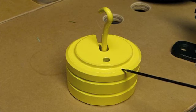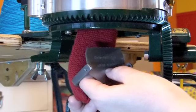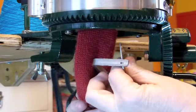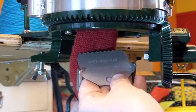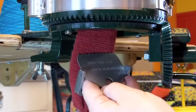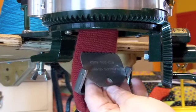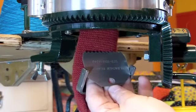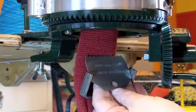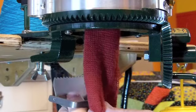We're going to go underneath the machine and I'll show you how to install the buckle onto the bonnet. The buckle has a little bar in the back — the bonnet slips through that bar — and a solid piece up top. I want my solid piece to be in the front, and I'll hang my yellow weights off that little circle. Because I form my heels on the back, I want the yellow weights hanging towards the front. If I were forming heels on the front, I would reverse and put the buckle on the back of the bonnet.